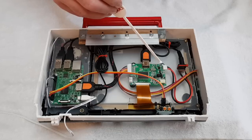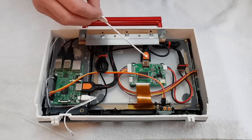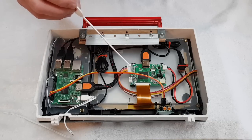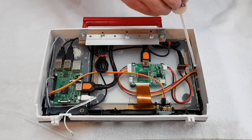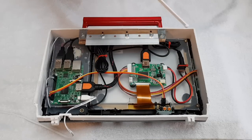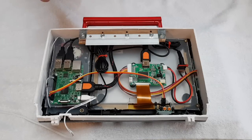The LCD panel itself is powered from the Pi, so here's where the power goes in — it loops around, goes along the top, and into the Pi, getting its five volts from the Pi itself. Also coming in on this side we've got the HDMI cable, which snakes around and connects up with the Pi. Lastly for the LCD driver board, there's this connector here which loops around to a board tucked away at the bottom, and that board has five micro switches on it. Those are the switches that control the LCD panel options, so you can press the button on the side to adjust the brightness and contrast.